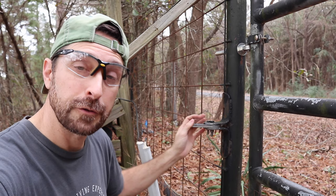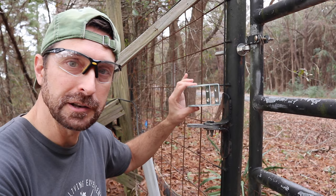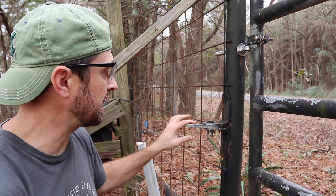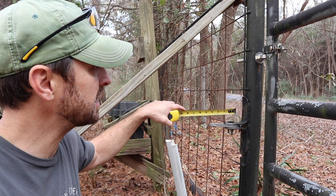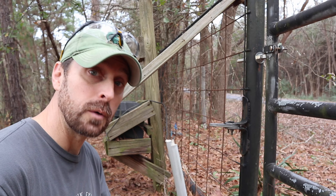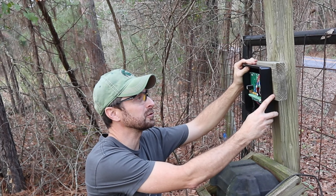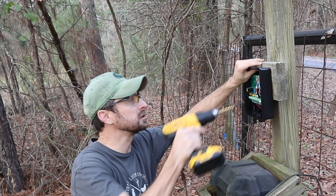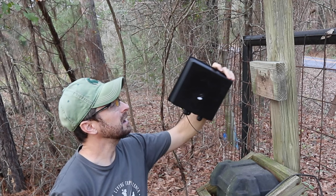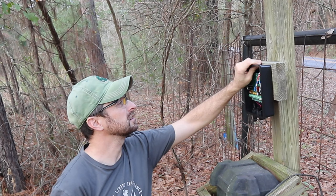For now, although it obviously doesn't recommend it, I'm going to attach it to the old Mighty Mule connector. These Ghost Controls have an upper and lower flange that the opener sits in between, but this old bracket only has one. So I'm going to set it on top like you would a Mighty Mule. I think I'll be okay temporarily, because the clearance from the gate is well within the tolerance listed in the Ghost Controls manual. I already have the battery and posts to set up the new control box — it needs to be three feet above the ground and four feet away from the control arm. One thing that's odd: you have to drill through the back of the enclosure in pre-designated areas — they didn't make it with holes.